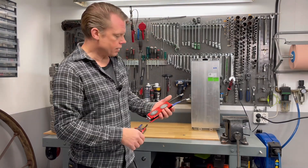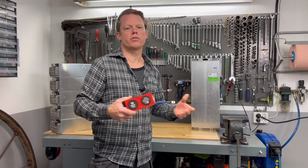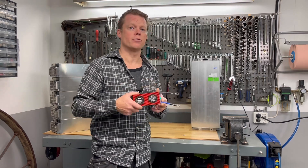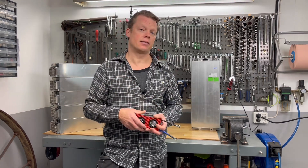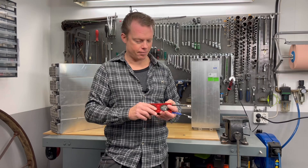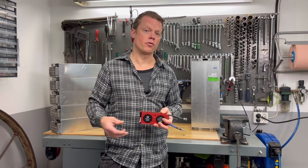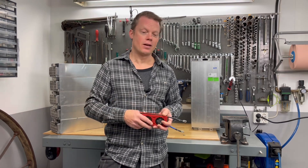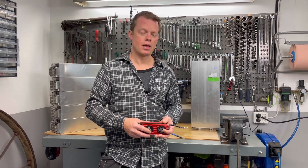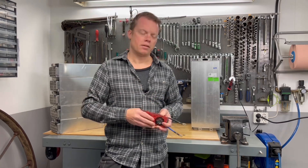As you might find out, it is not so easy to find the right BMS for it, because most of them are rated for lithium phosphate battery — and we don't want that. We want lithium ion in a 12S version of this BMS. I wrote to them and asked if they have a 12S BMS version in lithium ion instead of lithium phosphate, and they came back to me with a link to the same site I was looking at from the beginning, but on that site it only says 12S lithium phosphate.